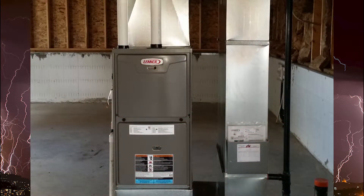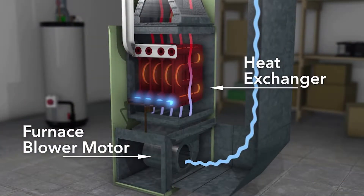The reason we use this with a forced air furnace is the way it heats up the room. It heats up its heat exchanger, then a fan blows through that heat exchanger and delivers hot air through the ductwork into the house. Near the end of its cycle, when the thermostat says the room is up to temperature, the furnace will continue to allow the blower fan to run to cool down the heat exchanger after all the gas has been shut down.